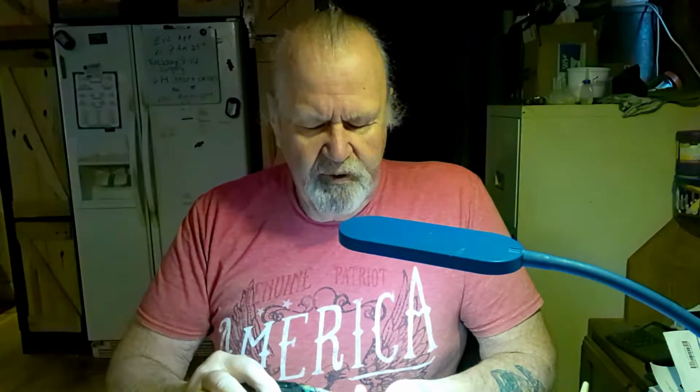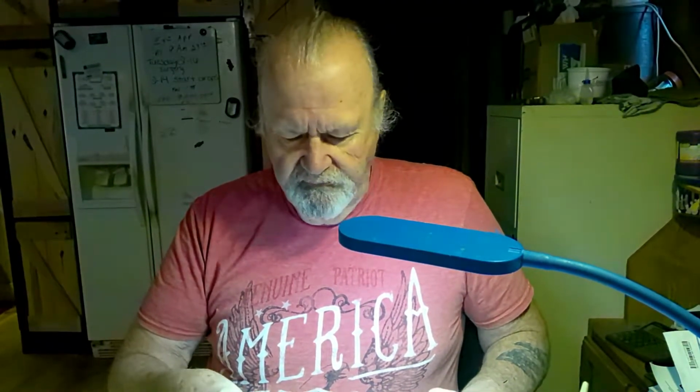This belonged to one of these guys that's a do-it-yourselfer. When you see people like myself and Scotty down there at Scotty's Gun Works talk about bluing guns, there's a lot more to it than just buffing one down and bluing it. He sat and watched some videos on gun bluing and making his home remedy, and he buffed all of his parts out, but part of his parts were made from aluminum alloy. And when he put it in the bluing salts, it just ate it up.